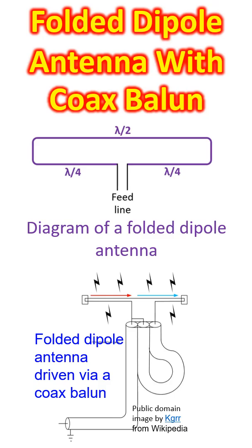While the usual half wave dipole antenna has an impedance of about 70 ohms, the folded dipole antenna has an impedance of around 280 ohms, so it matches well with a ladder line of 300 ohms impedance. Earlier, twin lead ribbon tapes were used to connect the folded dipole antenna to the television receiver. The folded dipole antenna also has a higher bandwidth than the usual half wave dipole antenna.